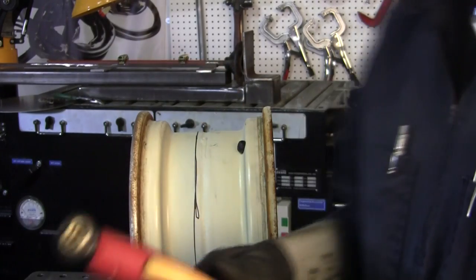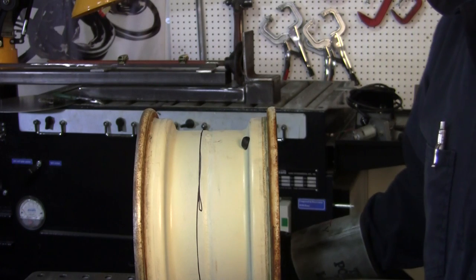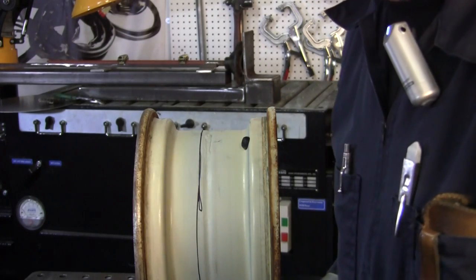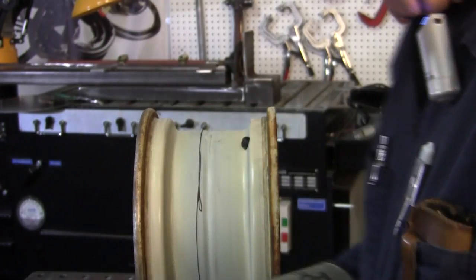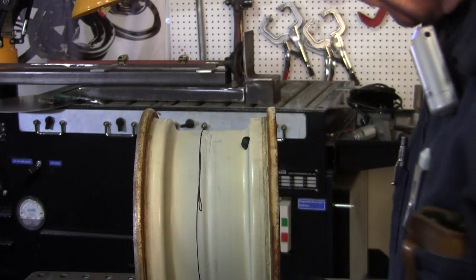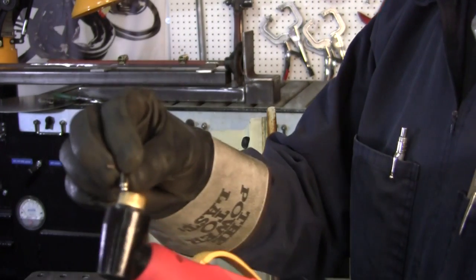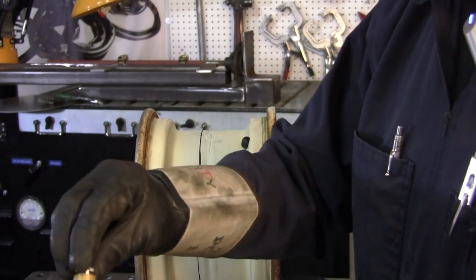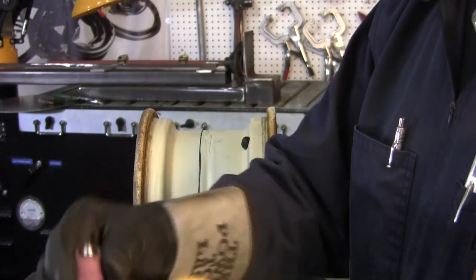Before I get started, I've got my cut line here. I want to show you something about your plasma cutter: the contact tips and cups. I just looked at mine and they're really burnt up, which means I've been getting too close. I'm going to use a guard to maintain the proper arc distance. I'm putting new tips on — that's a big thing, because you want to keep them nice and tight. See, it's nice and shiny now. If you ever need replacements, we've got them. Keep these tips firm — you don't need a wrench but keep it snug, otherwise it'll arc out.